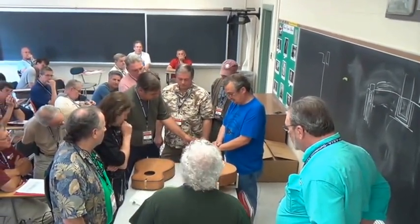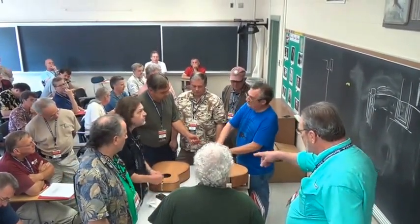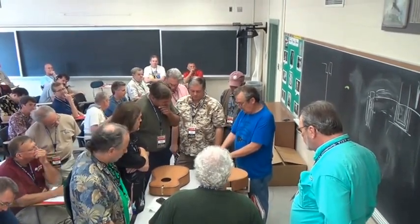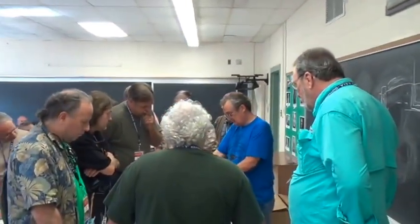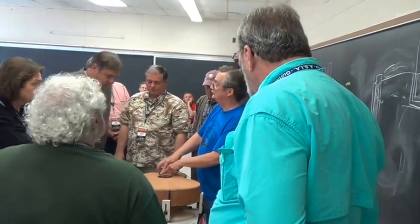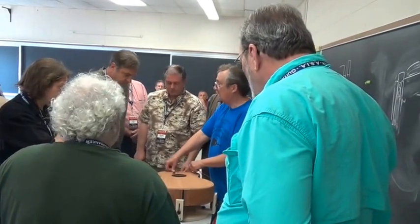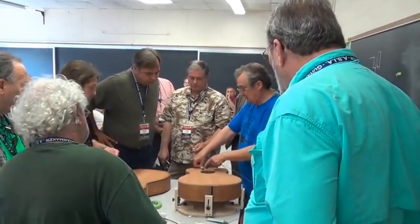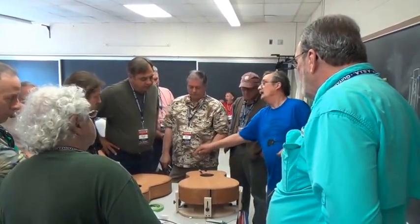So you didn't do that all together. You're only just doing one side of it. So I'm going to do all of it. Now, in a 45, you're going to have a pearl ring here. But now you've delineated the exact point where the pearl and the black, white, black outside point would be between here. So now you put a straight edge right there. So that when you meet, you're going to put one at this edge and one at this edge, you're going to totally surround the fingerboard extension. So now when you take the neck out, you have the outside lines lined out. And then you can scribe it with an X-Acto knife. Whatever, you can cut that out, and then your channel is coming in underneath the fretboard. Okay, now you got it.